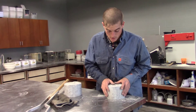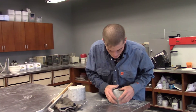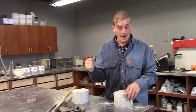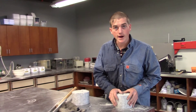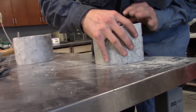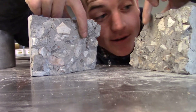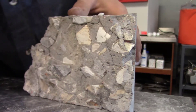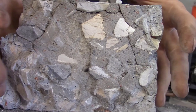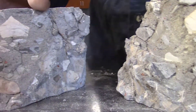Let's take a look inside. So what happens while it's in the furnace is all the aggregates and the paste inside start to expand and push everything out of the way, causing internal cracking. Whenever it starts cooling, we can see cracking on the inside and outside that's very visible. Look at all these cracks — so many cracks. The concrete cools and starts to shrink and pull back together, but all those micro-cracks expand. This is degradation of the concrete.